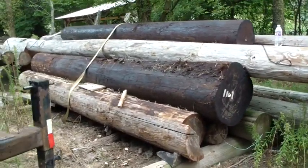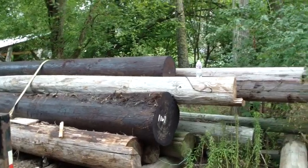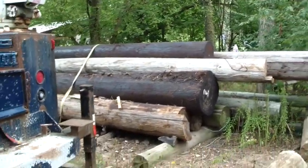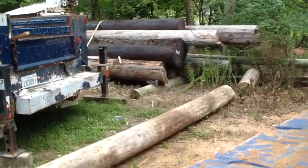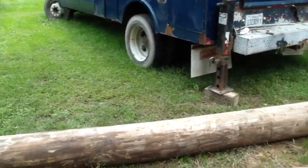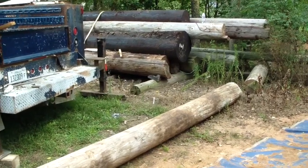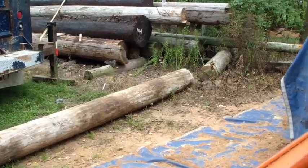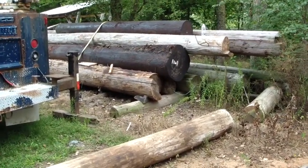These 6x6s — if I went to my lumber yard to get a 6x6, it'd be about $85 for a 16-foot 6x6. Six of them is over $500 just for six 6x6s. These poles have treatment in them so they're good for ground contact. We tell the guys we saw for: you can use roofing tar and coat the butt of it before you put it in the ground. We put ours in the ground the same way the power company does — just use rock — and they've lasted a real long time.